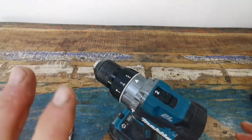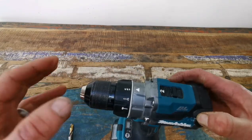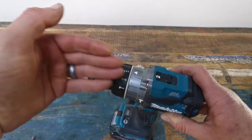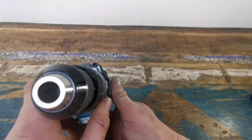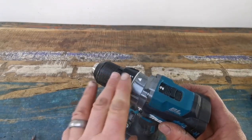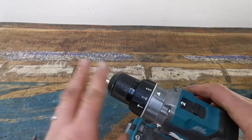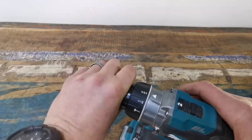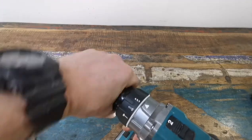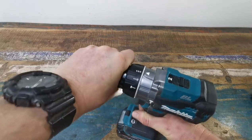Back to the problem in hand. My work colleague gave me this drill and said the chuck's jammed. This is such a powerful drill — if you hold onto the chuck while you're releasing a drill bit, the jaws get driven all the way back so it's fully open like that. You can see the jaws are all the way to the back. It has a tendency to jam. See that? It's gone really really tight and it won't release the chuck.